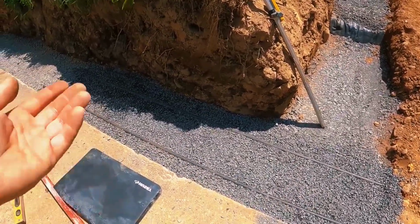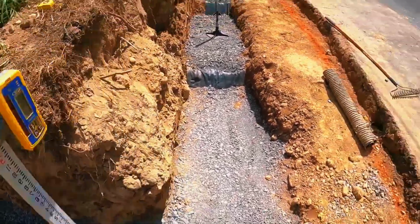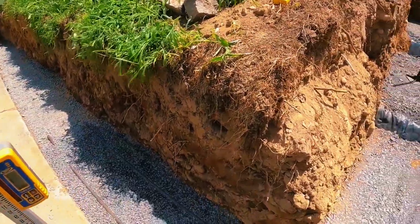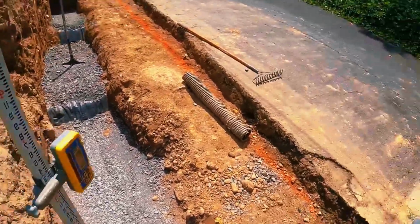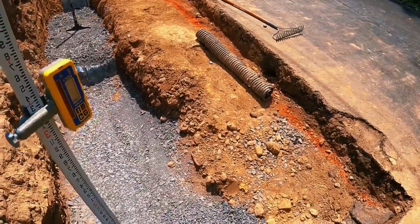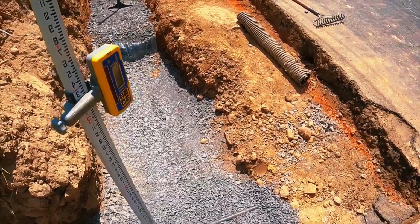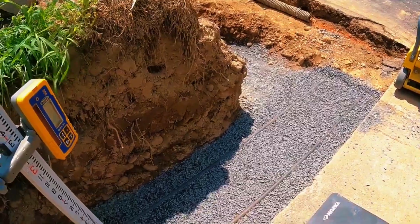And what we'll do is we won't pull these pipes out, we're just gonna slide them and keep going. But also, you wanna have your laser level set up so you can make sure that your pipe isn't slowly dipping down or getting off level from where you started. So after you have your first set of pipes in, like we did here, you just get your 0. You can see, oh, I wasn't on the pipe. There we go. So that's our 0 mark. And what we'll do is, every time you hear that solid beep is when it hits it.